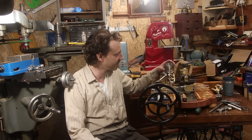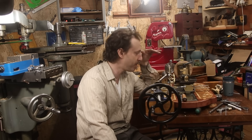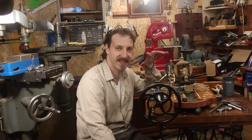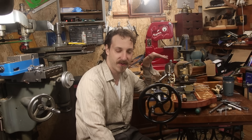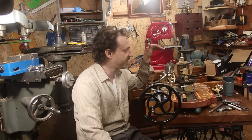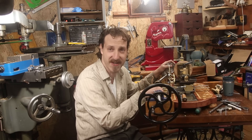I have to admit some sort of defeat. I thought this was a good idea — obviously there's a lot of backlash — but I do understand now why most ornamental lathes or rose engine lathes have the cams on the spindle and the headstock oscillates.